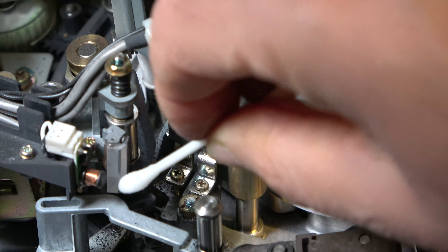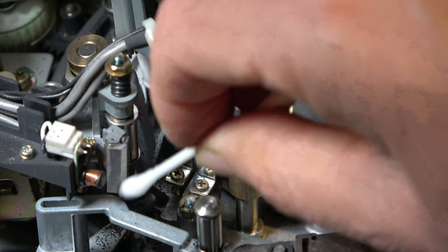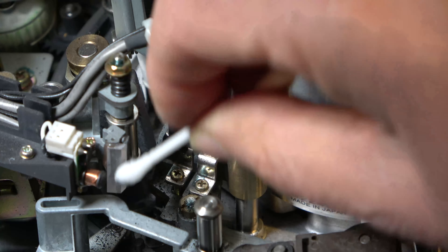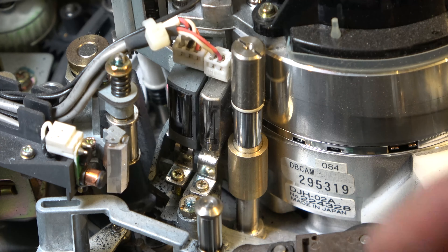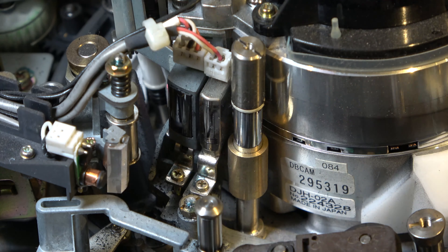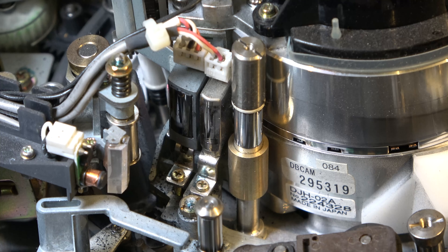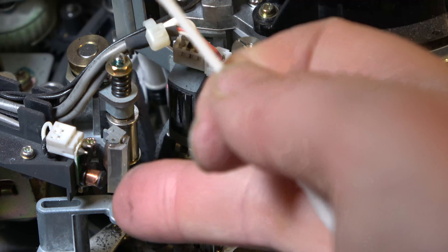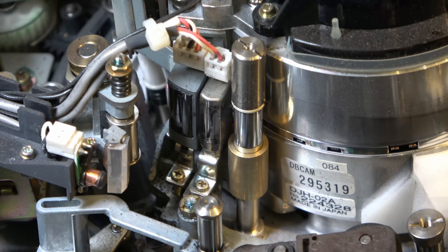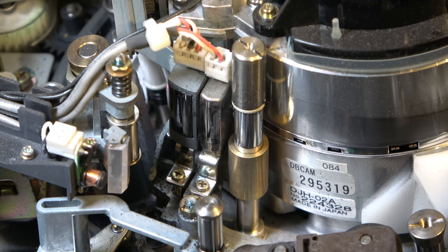This, in case you don't know what it is, is a sapphire block which burnishes the tape — so if there's any loose material on the tape, that takes it off. What a wonderful design. This is the end sensor here, which operates exactly the same way as Betamax — because of course this is a souped-up version of Betamax — so that looks for the metal leader tape. In one sense, this machine will play a Betamax tape provided it's been recorded with a Betacam oxide recording.